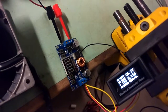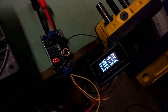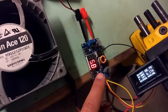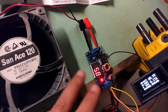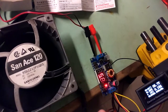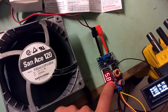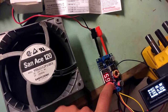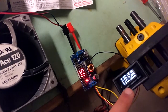The display shows about 170 milliamps. The display seems to be flickering, but it's not — it only flickers when you are setting the voltage, and when it stops flickering the voltage is set and applied at the output. We'll start incrementing the voltage in 0.1 volt steps. It's now applied and the display has stopped flickering. It's now absorbing 220 milliamps.